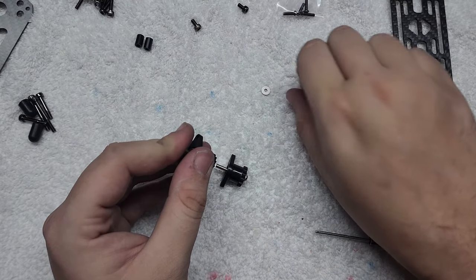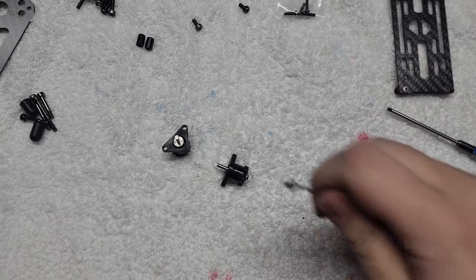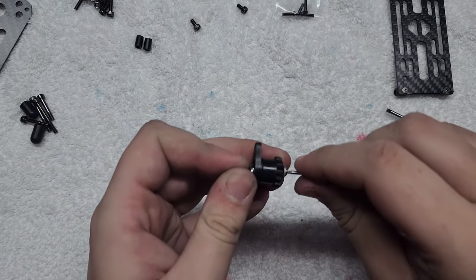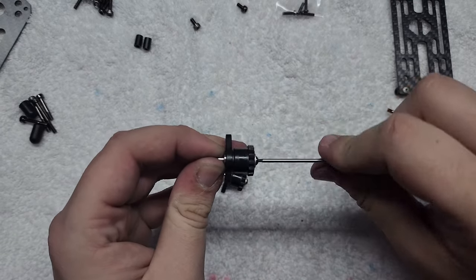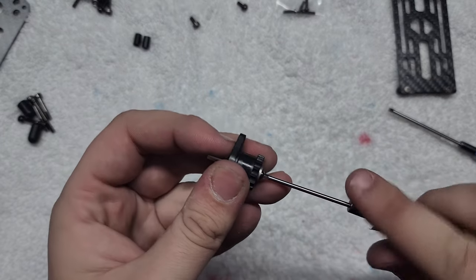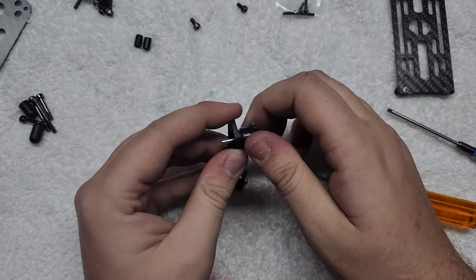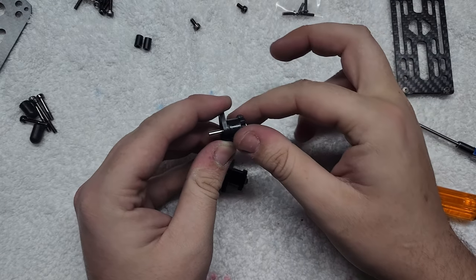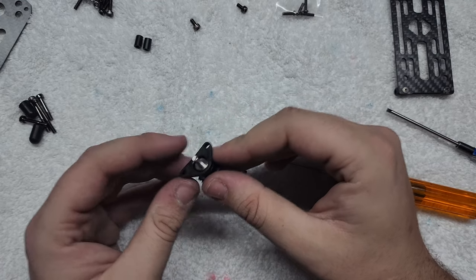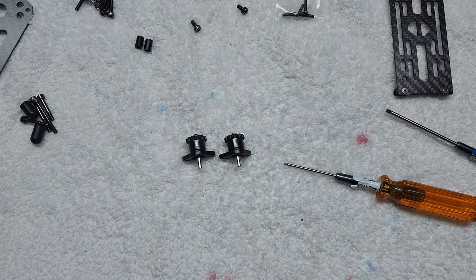Okay. And take a screw, put the washer on it, give her the old Loctite, and then put the screw in, start cranking it down. You'll feel it complete there, and you can see when you twist it to the left, it pulls that pin out. Now, don't do it too far when it's not installed in the frame, because the frame acts as part of stabilizing the pin, keeping it straight. So, that is the two locking mechanisms.